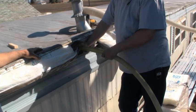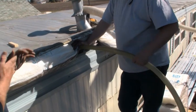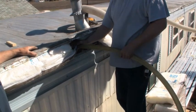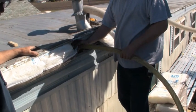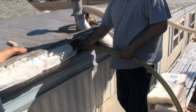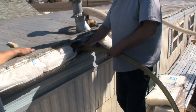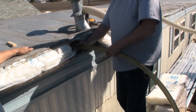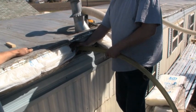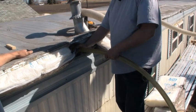We checked earlier before we started this. We checked the ceiling, checked with the client, see if there's been any previous leakage with rain, if they've had a problem with that. Mark the spot with a pencil or a marker, and then come back when you get all done. Or go inside, but sometimes you might have to brace the ceiling up. You might have to fix, maybe put sheetrock inside. But just be careful of those weak areas.